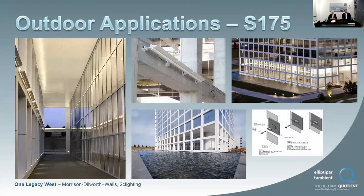One other point to make here would involve custom mounting. The top center photo is a dry run of mounting 3 fixtures in 1 bay just to get down the logistics of it. The challenge here was we were told they needed to mount all the mounting plates and hubs before the fixtures went up. They wanted to mount the mounting points and then come in with these white cladding panels that would leave a reveal joint and then put the fixtures up. And in a typical installation, it's hanger, fixture, and you keep building the row.